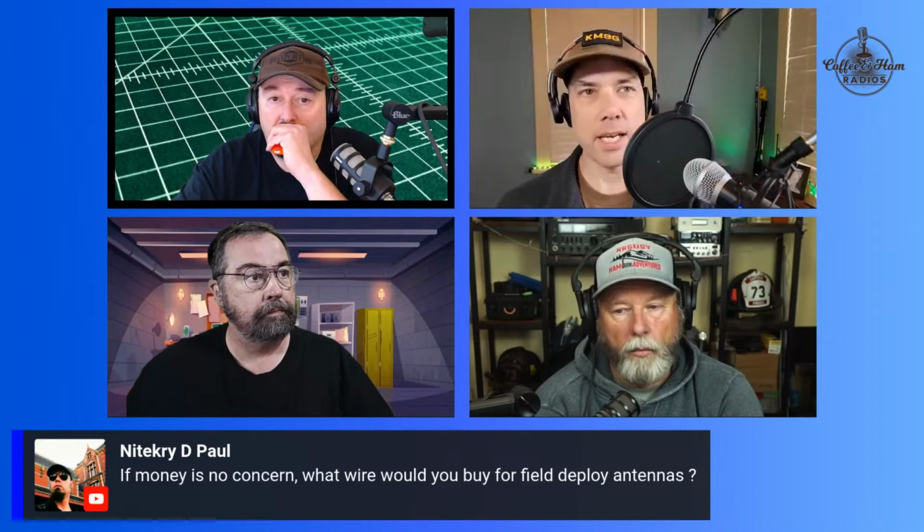Paul said field deploy, and that changes a whole lot of things. That brings a different set of compromises. The wire is not your problem in a field deploy. It's bundling it up and putting it in your bag, and then unbundling it and putting it in a tree, and so on. There's a different service life on a field deploy antenna than on a permanent antenna. A permanent antenna is where you want to spend the money on wire.